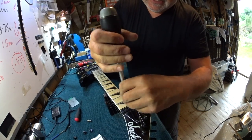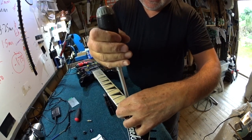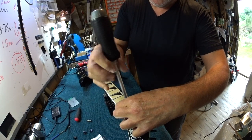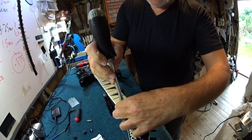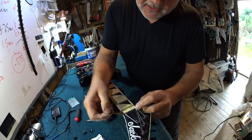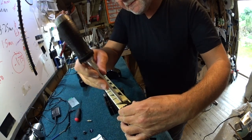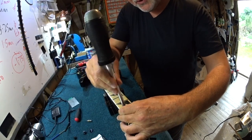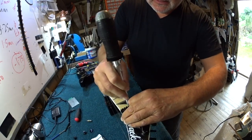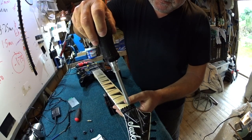So I'm just going to remove temporarily the locking nut. Okay, and lift it clear in a second when I've got all the screws all the way out. Now, there's nothing massively over scientific about all of this. There's a little brass shim under there which keeps the whole thing higher than it needs to be. Now I'm going to remove that and just, for the time being, replace this. Now, if this is lower than what I want, then I can come back and add something else under there to lift it up, but not as much. But let's see what we get when we put this back under this way.